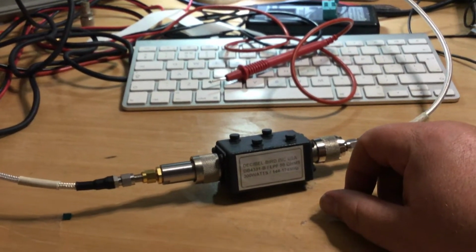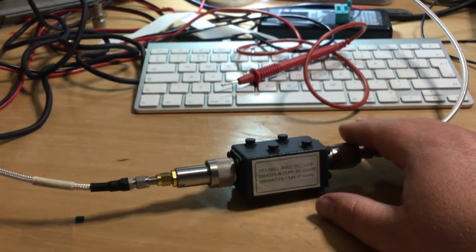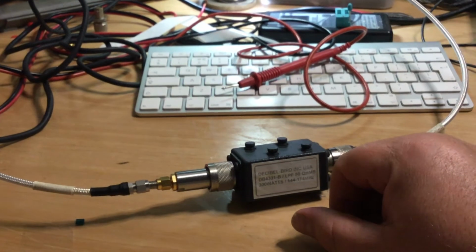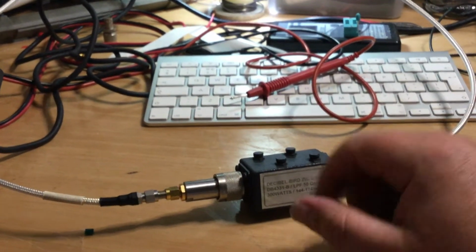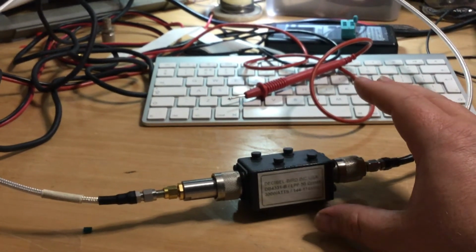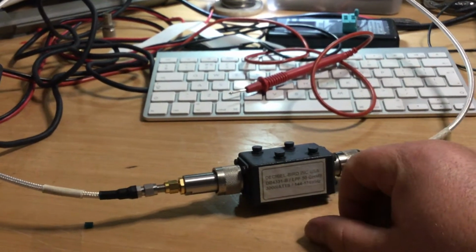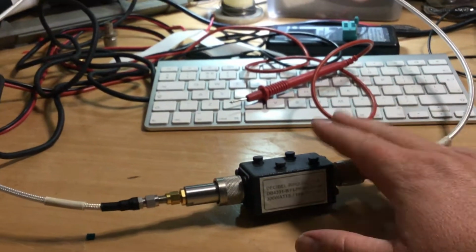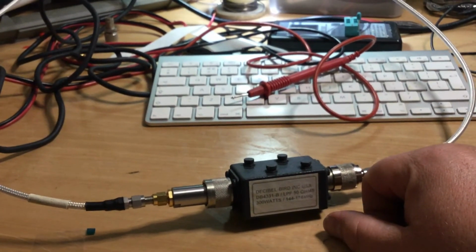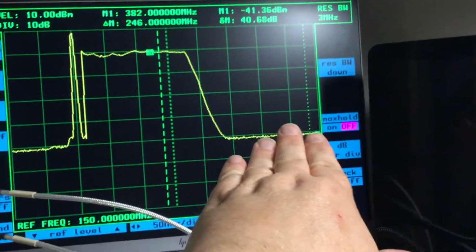And unfortunately, it's often the case where you'll be transmitting hundreds of watts from an external separate RF amplifier, and along with that fundamental signal, the desired frequency you're wanting to amplify, there will be staggeringly high harmonics that go with it, and some of these harmonics are so bad that they can cause mass interference elsewhere in the radio spectrum. So that's why you would employ something like this on the output of a linear amplifier, so that it would attenuate any harmonics that are appearing higher up the band.